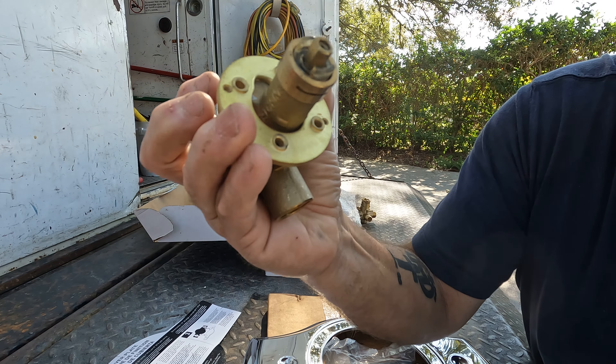It's a nice feature — nice to be able to do that if your customer wants new trim, this is how you do it. You can't otherwise, because you can only get chrome for these old valves. I just wanted to share that with you — try to get away from these smitty plates. This smitty plate is a Moen, but these things I don't like using — they're kind of awkward, kind of a pain, especially on a built-up wall. So when I get a call to take a three-handle valve out and install a new valve, I always go with the Posi-Temp body, and this plate mounts right to that.